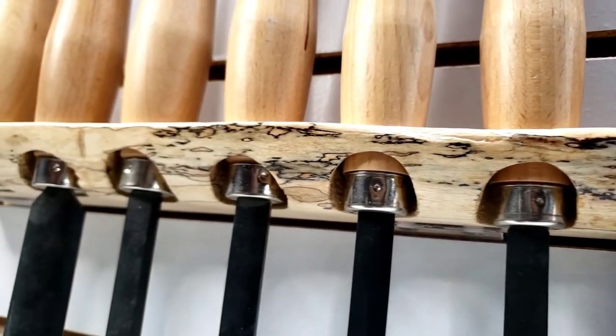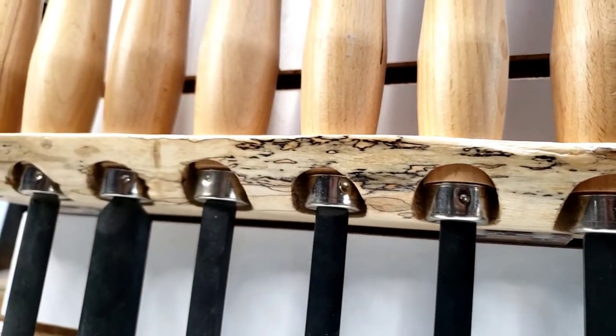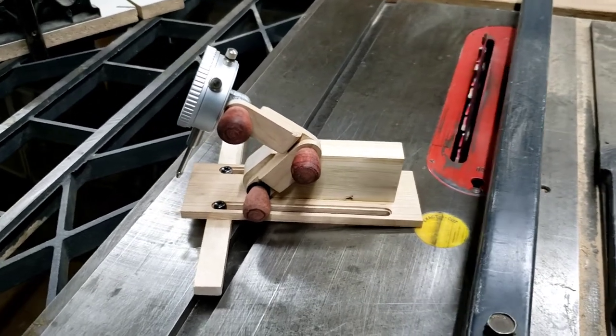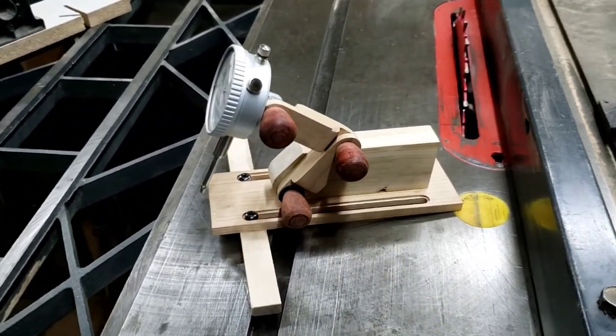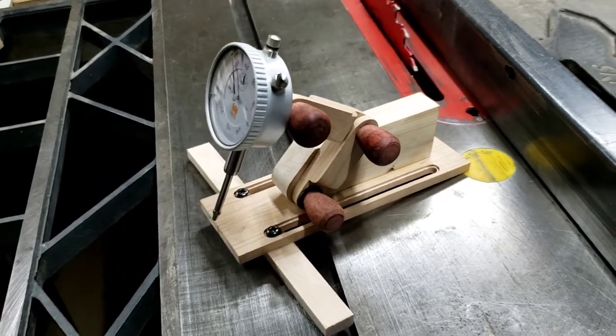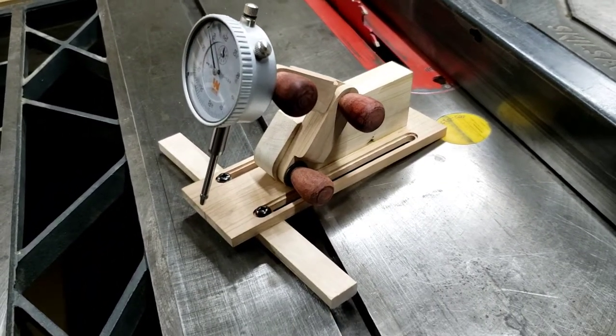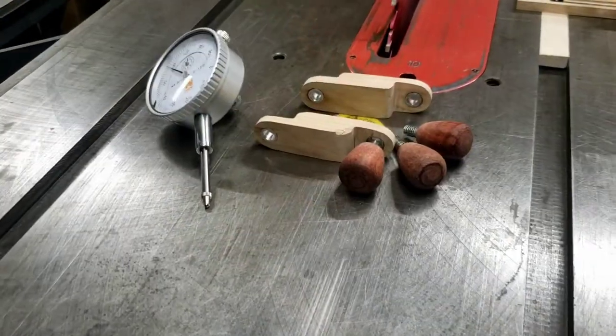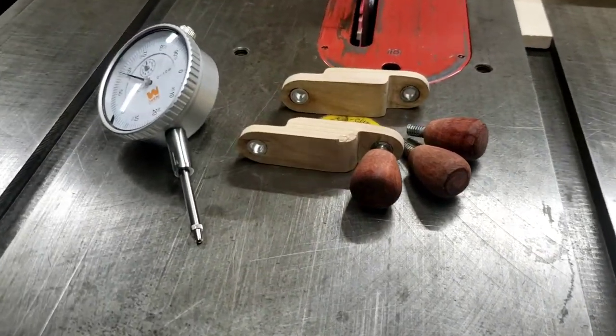It's been a real busy week and I haven't been able to get my trunnion adjusted on my table saw or my fence adjusted using my new jig. Some folks may give me weird looks for having a dial indicator in a woodworking shop, but I'm not looking for machinist-type tolerance in my project — I'm looking for accuracy in my machine, which results in a more accurate project overall and a much safer machine.